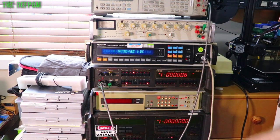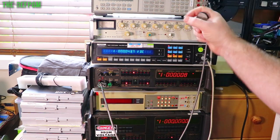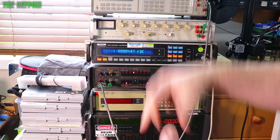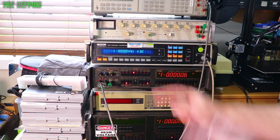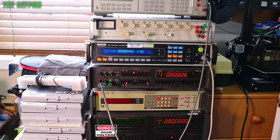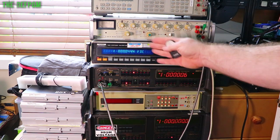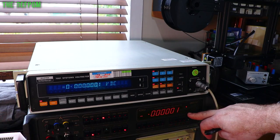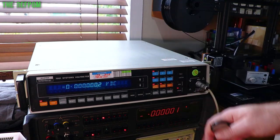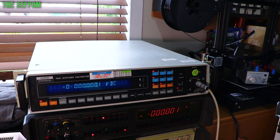What I'm going to do is change the op-amp out. I've cleared some stuff off the top to get ready to get into this casing. I'm going to turn the power off, lift the casing, drop that op-amp in, and we'll see what happens. First, with the calibrator at zero volts, both meters are showing essentially zero, so the zeroing looks good. I'm happy with that part of it.